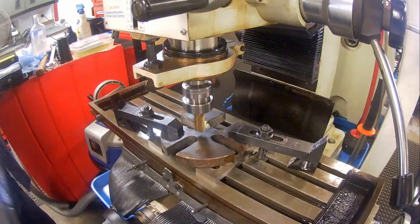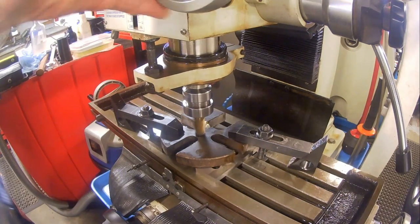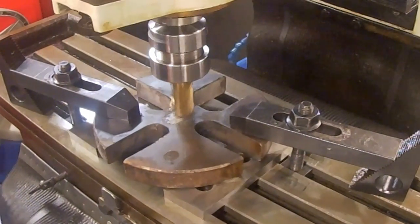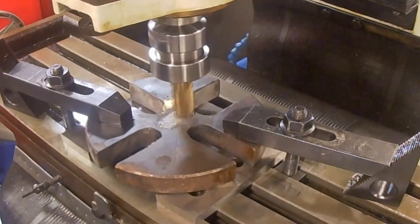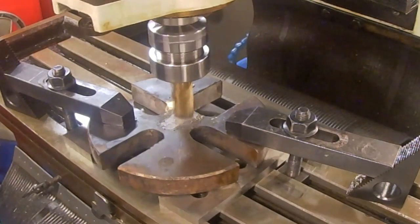Here, I have set the die plate up in the bench mill, and I am using a 20mm diameter end mill to machine the braze joint down to the level of the existing plate. All seems to be going well, but little did I know what fate held in store for me and our die plate repair.